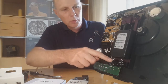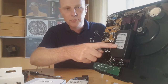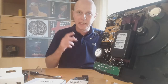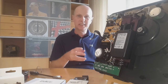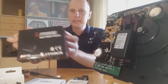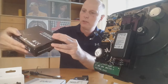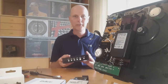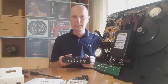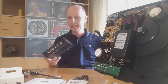Here you also have the battery — this is the normal position where you put in your standard alkaline batteries. I replaced it with a rechargeable lithium battery, and I must say that is maybe the best modification on this unit — now being able to just charge it up. I use this lithium battery, which you can also buy on eBay. This is the 12 volt 6800 milliamp-hour one. This thing runs forever with this — I think at least like 100 to 200 records maybe. It just keeps on running. The only time it runs out of juice is when I forget to switch it off overnight.